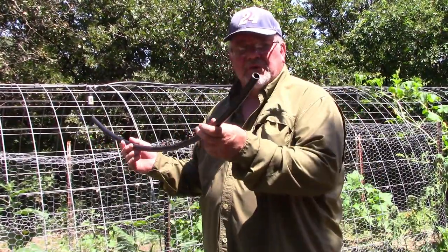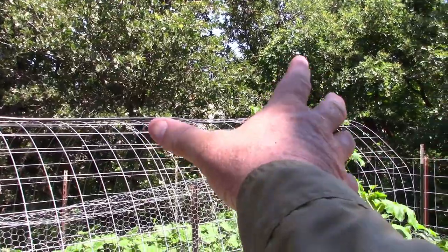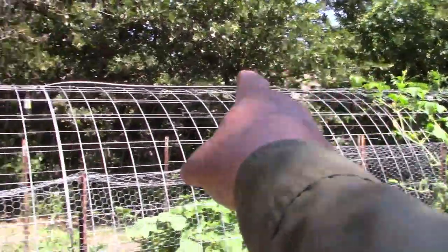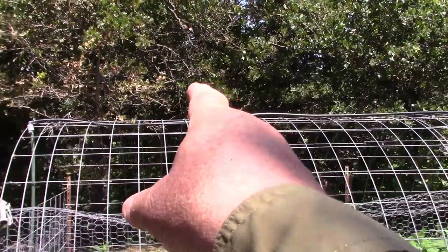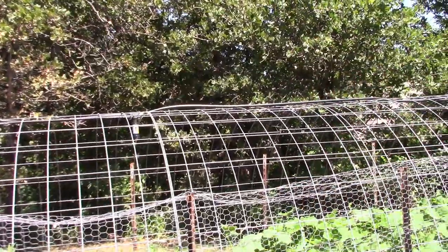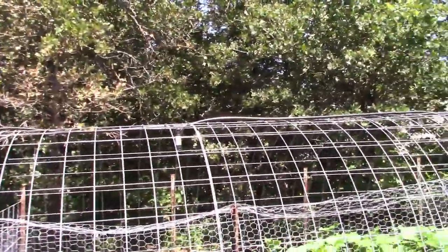I removed some pipe from the end and shifted everything. I took all the straps loose and shifted the whole pipe system four feet in this direction. Now one sprinkler is there and the other is there, and we should have overlap spray right in the middle. I cut the pipe right at that sprinkler, flipped it, re-pulled it through, re-strapped it, and reconnected it — and that's where the extra pipe came from. Let's turn this on and see what we're spraying now.